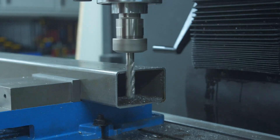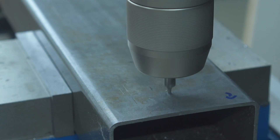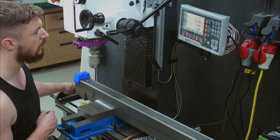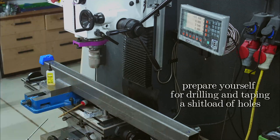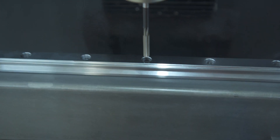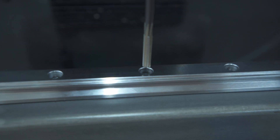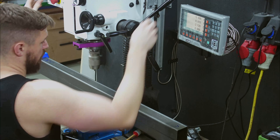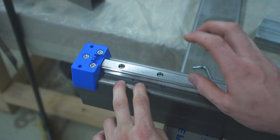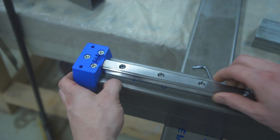As I tend to overcomplicate things, I didn't print out the 3D printed templates. Instead I used my mill with the DRO. Since my mill doesn't have enough X travel to drill all the holes, I drilled until here, then moved the whole beam to the left. To index the new hole I mounted a 6mm reamer to act as a go/no-go gauge so I can determine the X position. The holes for the linear rails don't need to be super accurate since there is a lot of wiggle room.